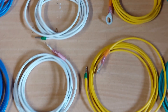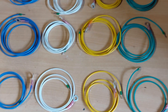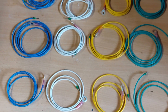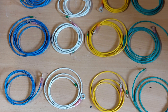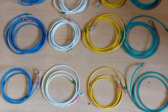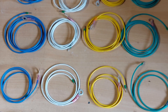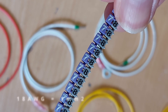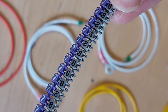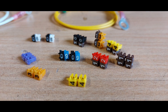At the start of this video you watched me crimping ferrules and ring lugs onto the balance cables. There are 17 cables — one for each positive cell terminal and a negative connection. There isn't anything special about the colours, it's just what came in the pack, but I have used red and black for the most positive and negative connectors. This is 18 AWG silicone wire, and I bought these numbered cable markers which I'll attach to each end of the cable to help with identification. I'll leave Amazon links in the description if you want to buy anything similar.